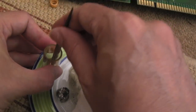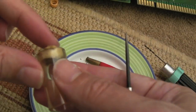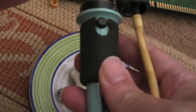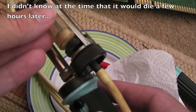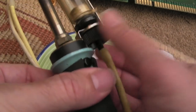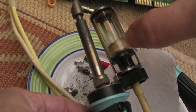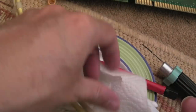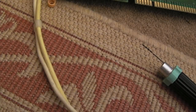I'm going to reuse that filter just by pressing it down - it's mineral wool - with a bit hanging out to fill that void. It's on its very last legs. Carefully insert that in there and tighten it up - not too tight, because remember that glass is going to expand with thermal expansion as it warms up. There is a rubber ring there to help alleviate some of the pressure, but if you tighten it too much it will crack.